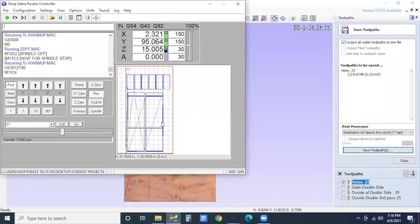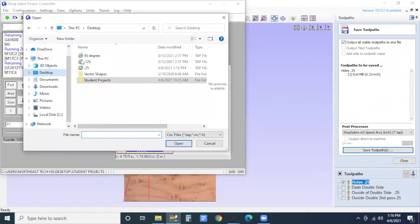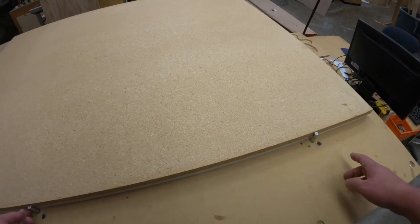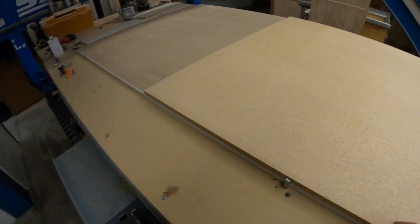Once I've saved that, I'll come out to the machine, put the pins up so I can align my board, and turn the vacuum on. While this is running, it will pre-drill those holes for me so I can align my piece. When I open file 0.25 I should see just two holes drilled in there — that's what we want. I'll get my board lined up to the index pins, nice and tight against all of them, then turn the vacuum on to hold it in place and hit enter to get it running.